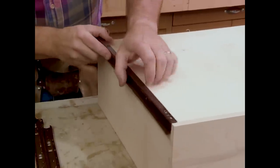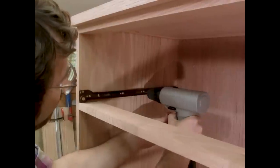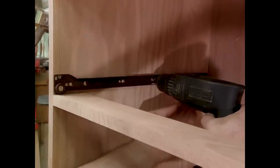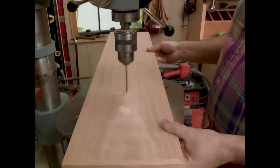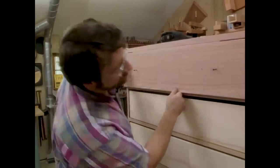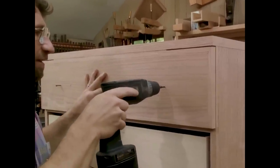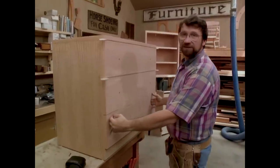That's how we make the drawer boxes. The drawer rides on tracks. This is the part of the track that goes on the drawer bottom. This is the corresponding track that gets fastened to the side of the drawer case. Here I'm drilling holes in the drawer front for the handle. I find it's easier to install the drawer fronts with the drawer boxes installed in the case. I just use a shim as a spacer, align the drawer front side to side, and use some screws through the holes I just drilled to attach it. Now I'll remove the drawers and attach them from the inside permanently.